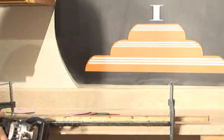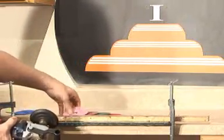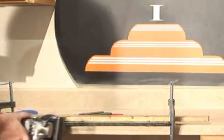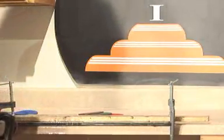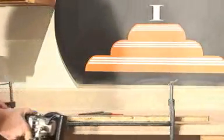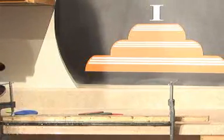Move on to the 500 grit. You'll be ready to move on from the 500 grit after the stone becomes visibly smooth. No scratches or imperfections should be visible after this pad. On some softer stones, if you dry the stone off, you may even begin to notice a slight polish. Note, you may quit polishing anytime the finish is satisfactory.